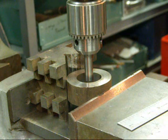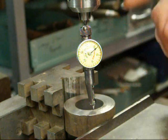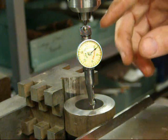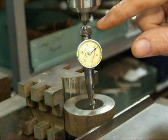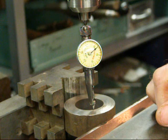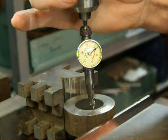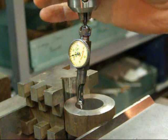Now we have that and I'm going to put the last word indicator into the spindle. We've got the test indicator mounted in the chuck — the little drill chuck. It could be mounted in a collet, it could matter less, but it does have to be mounted in the spindle, not in any other place on the machine, and make sure you don't turn the spindle on. This is strictly a static test that we're making. I like the last word indicator because it's got a little ball joint right here. You can use other test indicators as well that have the dovetail on the back, whatever you happen to have or whatever your preference is, but it cannot be a back plunger type — it has to be this smaller one that fits inside the hole. I've moved this so that we're roughly on center, pretty close to being on center with that dowel pin I had in there a few minutes ago.